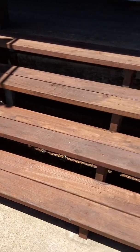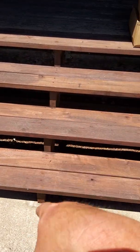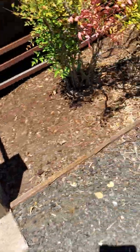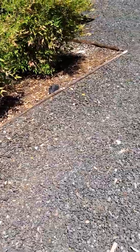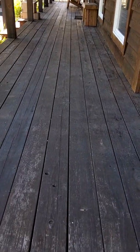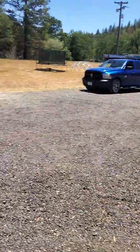Here, obviously, I would recommend one. It's new. You don't ever want to go more than 2 foot on center for stringer space span. That's these, not tread boards, but the supports for the tread planks. So that's 4 foot. Eventually, you're going to want to put 2 more in there. That's going to eventually go. Let's see. So your 16 on center joist span is important because if you ever did want to go Trex, which I don't think so, for this kind of wood and everything being so matching, you probably would want to stick to the same kind of wood as already been existing, and the deck's still in pretty good shape. No open grounds at all. You also got gutter covers, which is important to note.